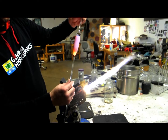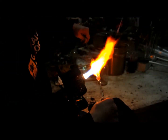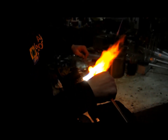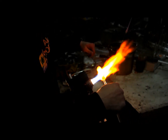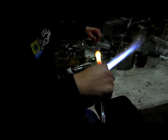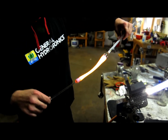Now with a seven millimeter handle, I heat a section to pull. Slowly give little tugs — don't over-pull it. Rocking back and forth helps the glass pour off evenly. Now tiny tugs till the center is just about your size. Don't try to pull it all at once or you'll get thin spots.